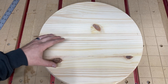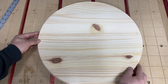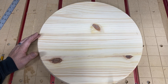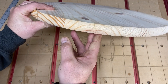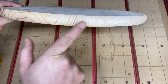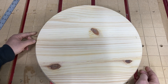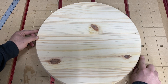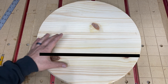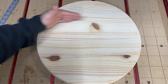I'm sure all of you said A, and that's because the graining and the seams of your joints are horizontal left to right. That's very important when you cut these. For any of these processes, you want to make sure that your board — once you find your center and set up your file — is running in this parallel direction. The easiest way to do that is to turn your blank on its side so you can see the joints, then line up the seam with one of the lines on your spoilboard grid on both sides. Now you know your board is set up correctly and it's going to look right visually.